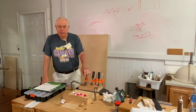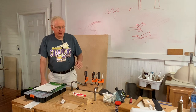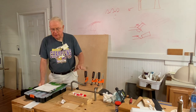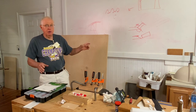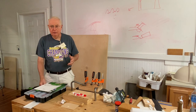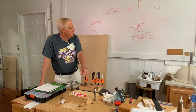Got all kinds of really nice furniture. And in every one of the rooms, there were these little decorative boxes, big ones, little ones. I was interested in making them, and there were a lot of octagonal boxes, and I wondered how they made those. I went in one room and there was an octagonal box, and I asked the curator if I could pick it up. He said yes, so I picked it up and turned it over to see how the joint came out. As soon as I saw it, I said, "That's a bird's mouth joint. I can do that." And then I found out they made a router bit that cut it. Once you get it set up on your router table, you knock those things out in no time.